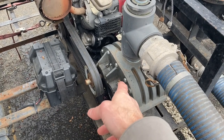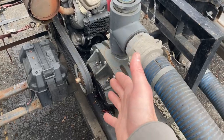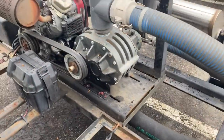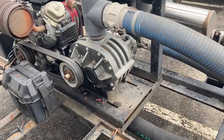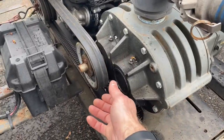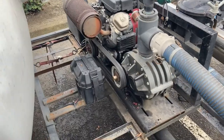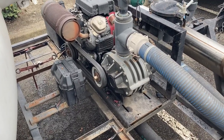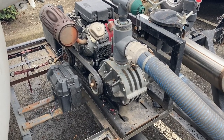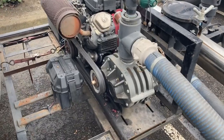This is just like the kind of blowers they stick on cars with superchargers. It's basically a supercharger. It's just not designed for automotive applications. Actually, it's not the same. It's almost the same kind of blower that you would find in a carpet machine. The carpet machines actually have two drive shafts because they push other things, water pumps and things like that. But basically, this is a Tuthill 4005-21L2 5-inch roots blower.